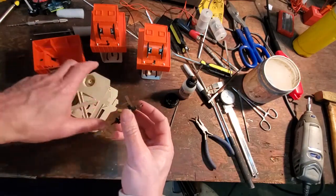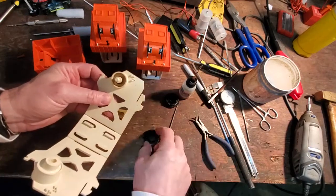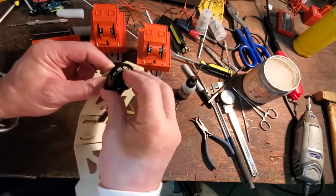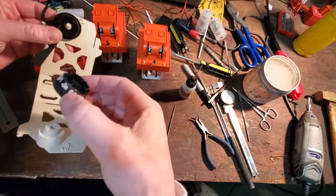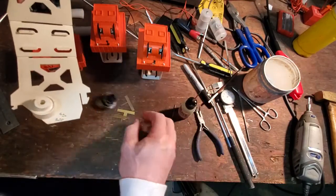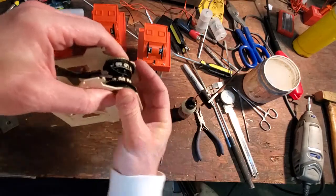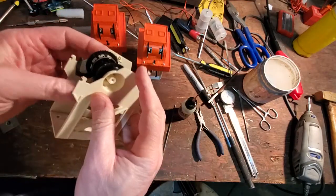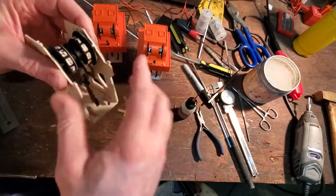This tab is really important on this arm — you want to make sure it's going to go up against that finger of the spring. It doesn't matter where the position of the ones are, so I'm going to back this all the way up and then rotate it through. Now I'm going to place this gear on there and put a little bit of oil here and a little bit there — don't do too much. Work that in, and now we're going to press the whole thing together. These were both rusted and I took them to the bench grinder wire wheel. This should spring — you'll see that springs really nicely. I think the oil helped just a bit.